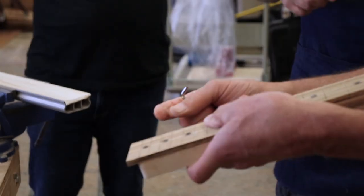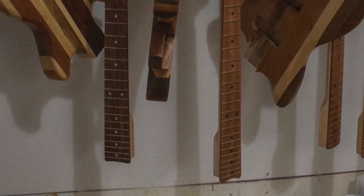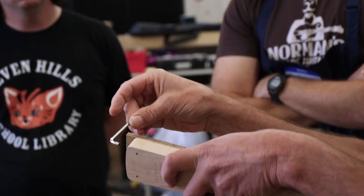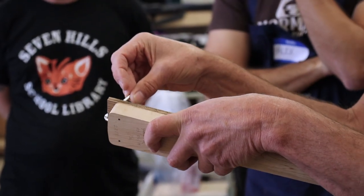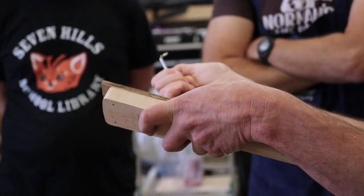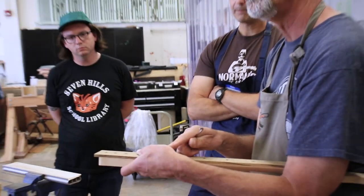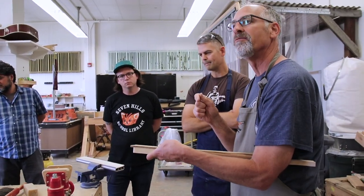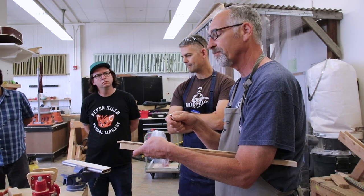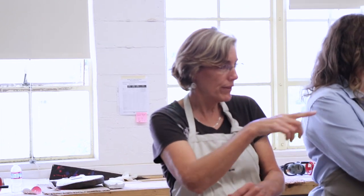You'll end up with just a little arc right here. You can also smooth out these sharp corners and kind of dress up the end of the fretboard, and you'll be able to get that tool installed and adjust the truss rod without having to take the neck off the guitar. That's just a really easy operation with the spindle sander or the two radii on the end of the belt sander.